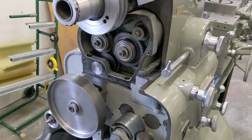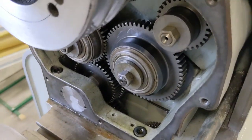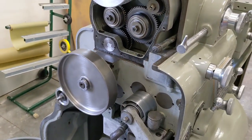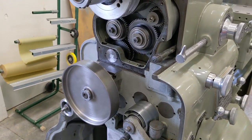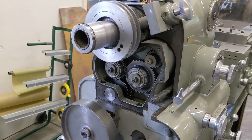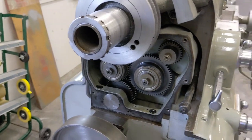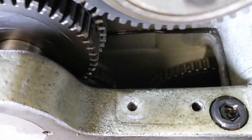It's a bit of a head-scratcher. I don't think I'm going to find a magic solution here other than all these gears having a little bit of wear on them. What I'm going to do for comparison is take the cover off my other machine that appears to be not so noisy — the back cover — and just see how noisy it is. Then I'll pull the cover off on the other machine and see what the backlash looks like.